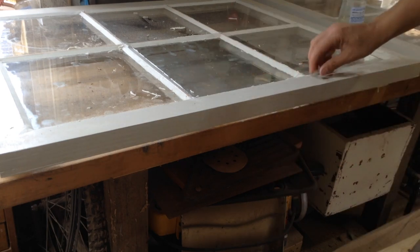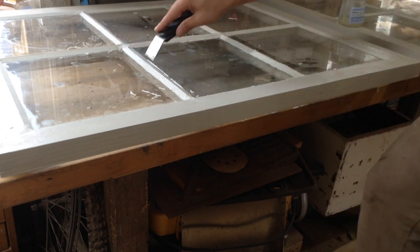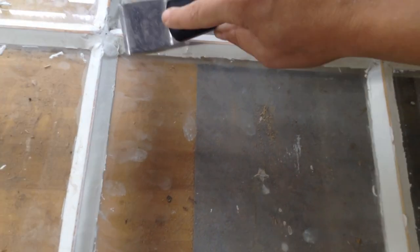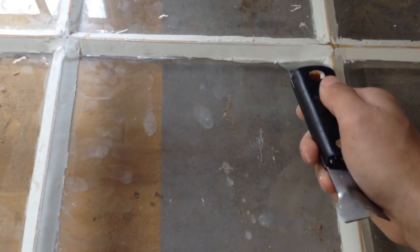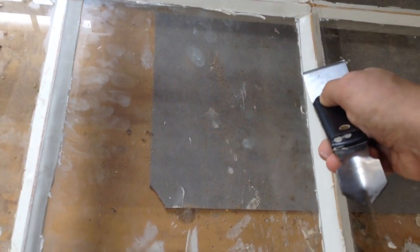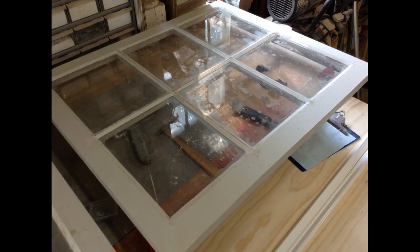You're basically trying to get a nice smooth line with no ripples and not too much putty. After a week or so it sets up enough to paint, but it's been so warm that it hasn't skinned over yet. Smoothing it out is pretty easy and you're left with nice sharp edges, corners, and fresh glaze on the windows. I have two quick photos of what they look like in my shop — still filthy since I wait until everything's dry to clean the glass — but that's basically the project.